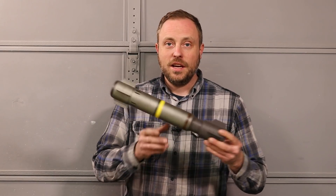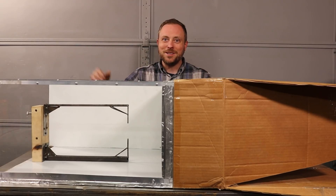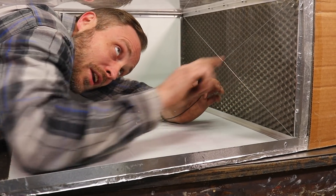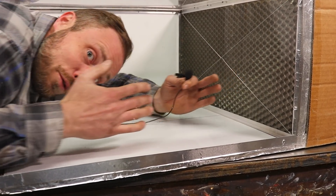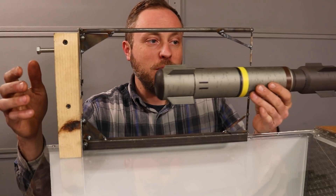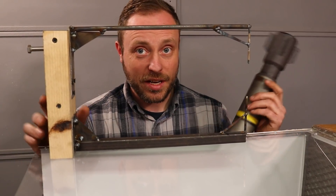But that test only tells me two things: where the balance point is, and that this thing would be really dangerous to fire right now because it would go all over the place. Which is why I made this — my homemade wind tunnel and rocket calipers. The wind tunnel is pretty simple: there's an air filter and aluminum honeycomb to give me laminar flow, and I stick a fan in that end and it makes air move through. The rocket calipers are a little more complicated. I twist this bolt back here, it tightens these two points together, which lets me grab the rocket anywhere along its body. It can spin very easily because the points grabbing it are really small.